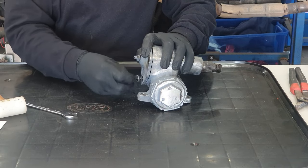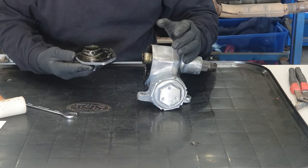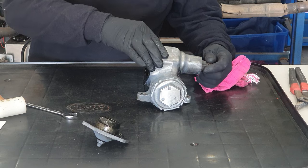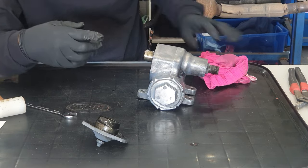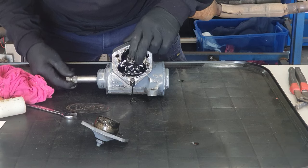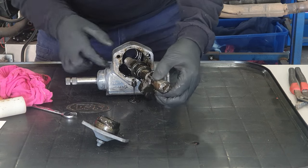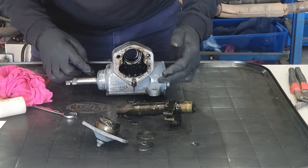Just hold the cap in there - there's a bit of a spring inside here you've got to retain. You'll see that's pushing it out. That grease inside is just turned to cake. With that part out, should be able to take this internal shaft straight out. I'll show you inside before I pull it apart. As I turn this shaft when it's in the right position, the ball screw is in that nut at the bottom and this bit just has teeth on it. This item here has a spring on it and a washer on it, so you need to make sure you keep them in the correct position.